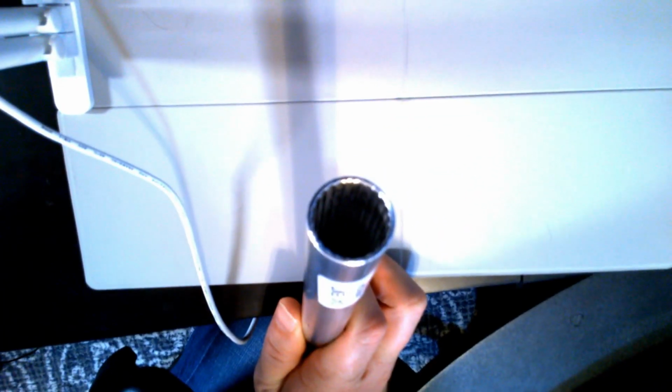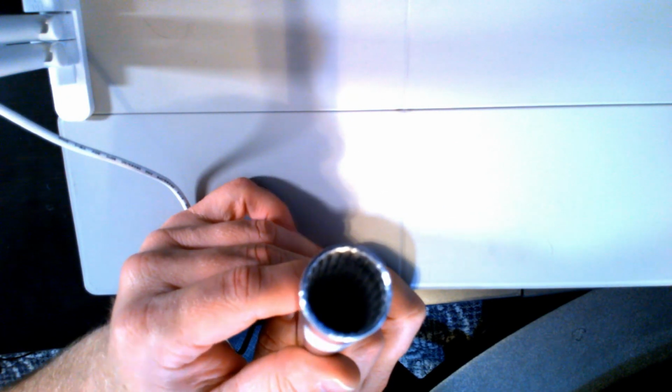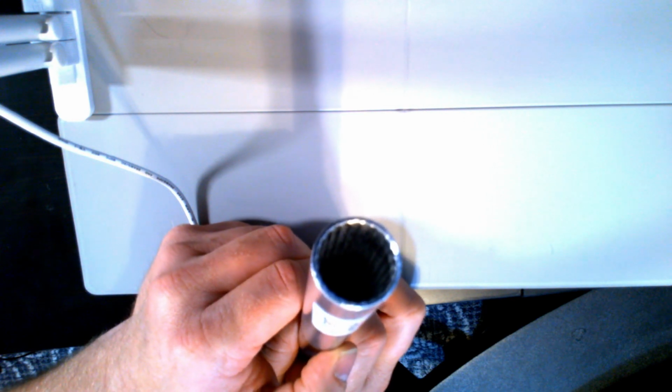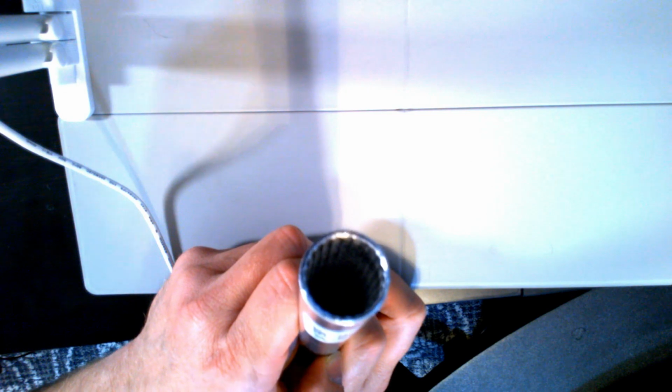Okay, so before I forget, this is from American Conduit, so I want to make sure I'm giving credit where it's due. This is an aluminum piece of EMT, and if you can notice, I'll kind of adjust my camera. You can see how it has ridges around the inside, and that's to make pulling the conductors easy. One of the knocks on aluminum conduit is that it's hard to pull through, and this actually makes it easier to pull the wires through. Not only that, but it adds strength when you're bending it, so that when you bend a 90 on it, the stress is distributed throughout the raceway, and it's not as likely to kink.